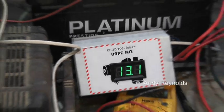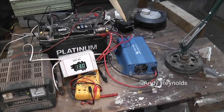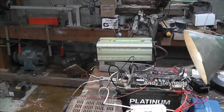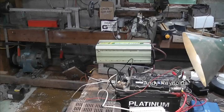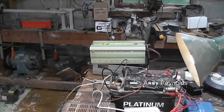That's a 350-watt inverter. You wouldn't want to try running a normal domestic fridge off that, as a normal domestic fridge may run at 50 or 100 watts but it draws up to 10 times that to start for one second. So you might want to use a bigger inverter - like that one over there that claims to be 3,000 watts, though I'd only really want to draw 600 watts off it. That's one I've got to fix yet - I was given it and haven't even looked at it, but maybe it's got a simple fault.